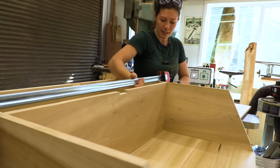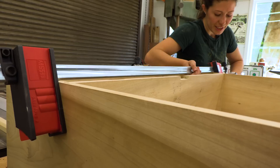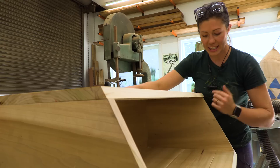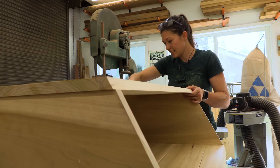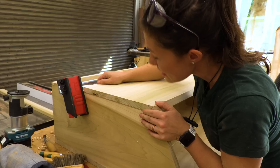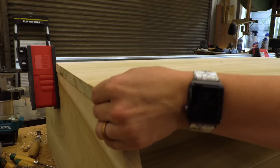I'm just going to put this on to make sure that we're as tight as we need to be on this dado over here because we're going to nail this on. I'll take the fall front, which I just cut this angle on the table saw roughly, and we will fine tune it with a hand plane shortly. I also wanted to leave both ends a little bit long so that I can flush everything up with a plane. One nice thing about hand tool woodworking is that if anything ends up not being quite square, you have a little bit of wiggle room at the end of the project to get it there.